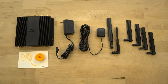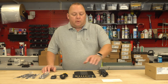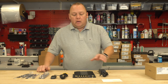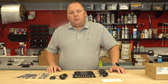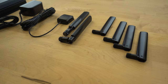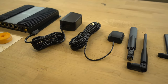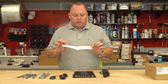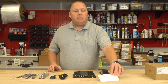In addition to the four cellular antennas, we have two Wi-Fi antennas. This unit has Wi-Fi 5 technology, giving you the ability to operate in 2.4 GHz, 5 GHz, or mixed-mode Wi-Fi. You also have the GPS antenna, some branded wire management cable, the router itself, and an AC power adapter with a 4-pin micro-Molex connector, as well as a quick start guide covering how to connect all the antennas and get into the administration console.